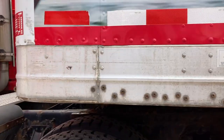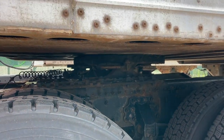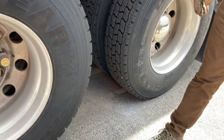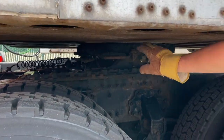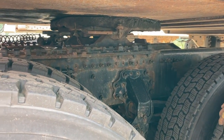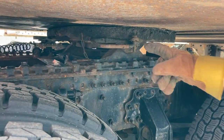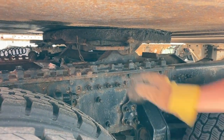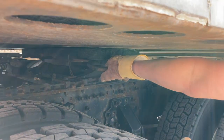Now P: Pull the release handle. Keep your foot away from between the tires because if the tractor moves you don't want it to run over your feet. There are different types of fifth wheels — sometimes you lift it out and forward, sometimes you pull straight. This is a Volvo; it works by pulling front, out, then front again to lock it.